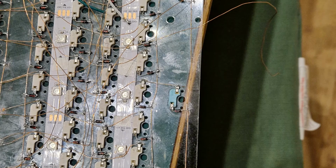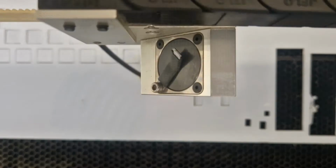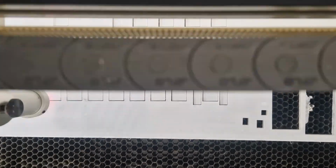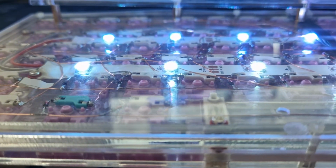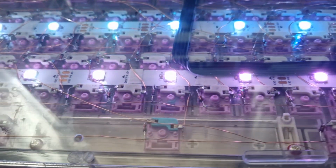This was much thinner and more finicky, but it was much flatter as well, and generally looked a bit nicer. This time, apart from some testing, I didn't use the keyboard until I'd cut out the plate and all the other layers. The layers were made up of 3mm acrylic. The bottom layer was 1mm acrylic, which worked well because it had a bit of flex to it. Here you can see everything kind of squashed up inside.